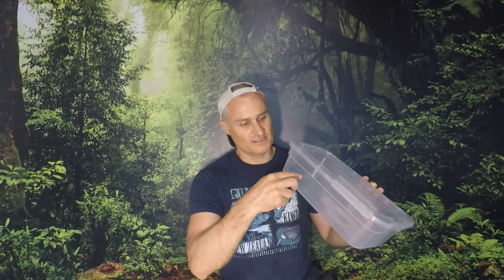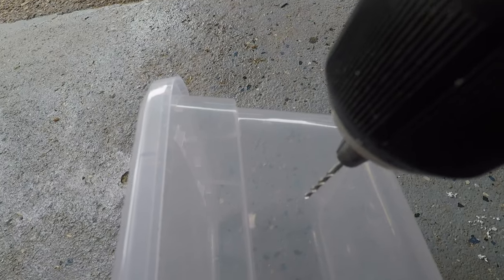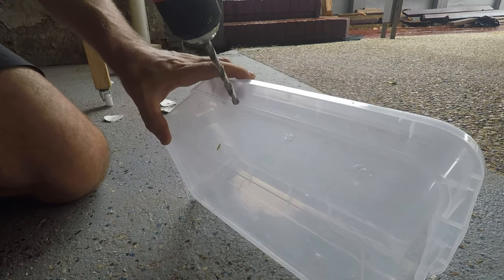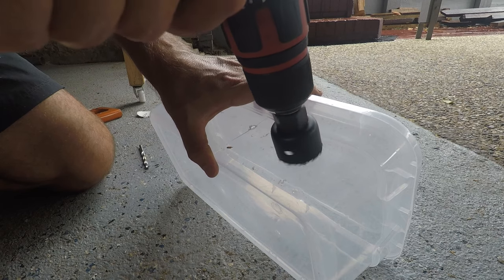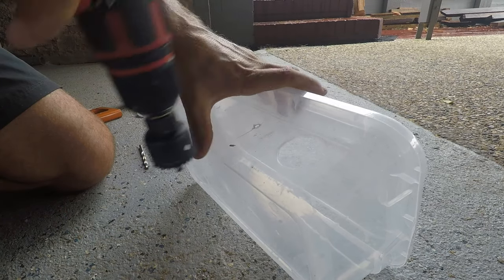When you're working with this plastic, it's very brittle, so you have to be very careful — provide support from the other side and just don't push too hard because it does crack really easily. If you don't have a cutter like that, you can drill a series of little holes and then slightly cut them out. Another option is, if you've got a round metal object, if you actually heat it up, it'll melt through — this is very thin, so that's another option too. Drilling out the pilot holes a little bit more will help with the other drill.